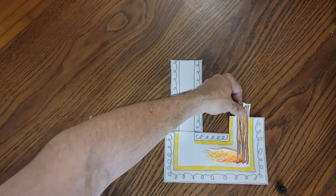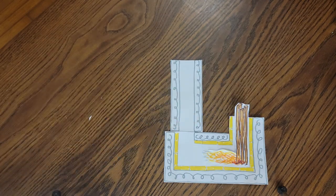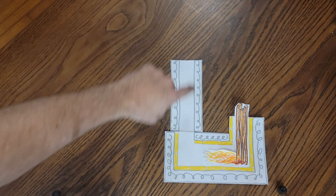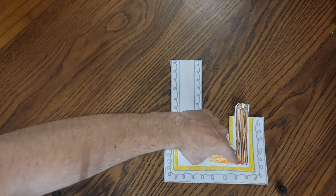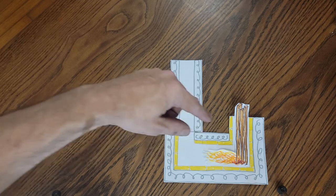So there's my wood scraps coming in the feed tube there. And this middle part, that's the burn chamber. When it gets hot enough, the flammable gases in the wood evaporate and mix with the hot air in the chamber and cause a violent chemical reaction that produces more heat — in other words, all the gases catch on fire. Over here at the other end, this is a riser or a chimney. The gases in the chamber, being hot, will tend to rise somewhat forcefully up that chimney, pulling more air in to mix with the hot, evaporated, flammable gases and catch on fire again.